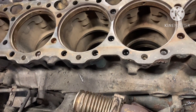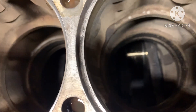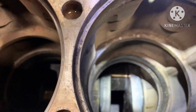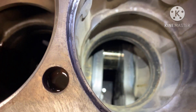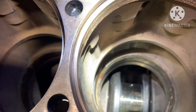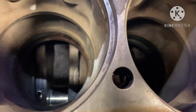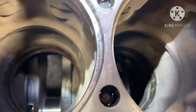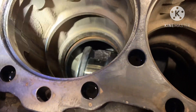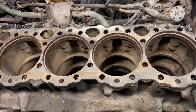We're going to start looking at these cracks. As you can see right there, that crack's pretty big — usually the ones we see aren't quite that large. We can correct them at the shop; we have a tool to cut the counterbores and cut the cracks out of them. We'd cut the crack out of the counterbore with our tool, and if it's not too large, we can cut it out and then shim it up to get the correct liner specs.